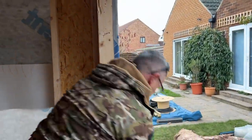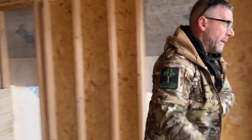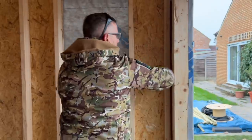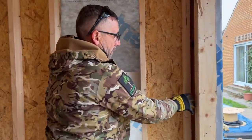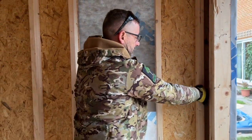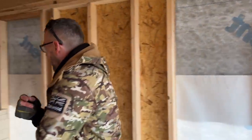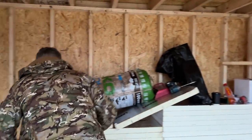Right, my next thing is now, I know all my doors are sliding to the left as viewed from outside. So my light switch will go either there or there, depending. It's probably going to go on that wall because I put a plasterboard carrier in. There's nowhere for my light switch otherwise. So that's where the light switch will go, and we're going to work back to the light switch. I'll explain that to you now.